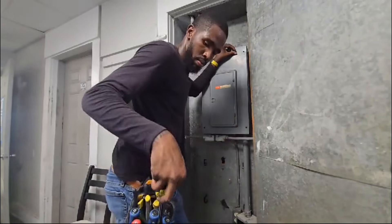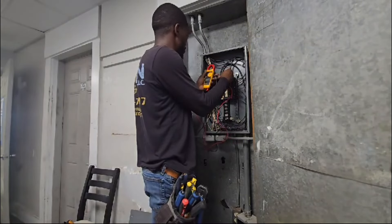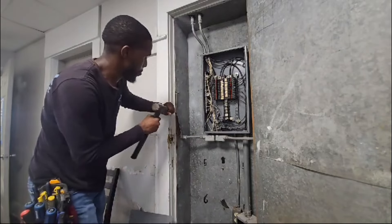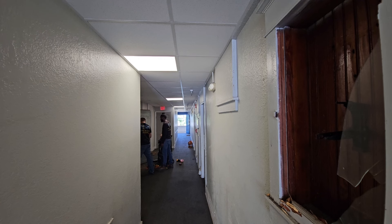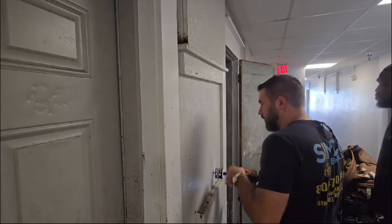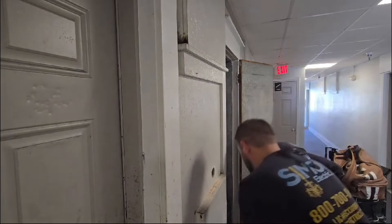This is pretty much the same situation as on the other floors. We're going to need to remove this FPE panel, or make it into a J-box, so we can relocate the new panel. The little cubby hole these are located in is not going to comply with NEC 110.26A, which requires 36 inches straight out and 30 inches to the side. Bernard is removing the galvanized sheeting so we can make holes through the wood for our conduits. On the other floors there were studs in our way, which is the same case here — otherwise we would have recessed the panel.